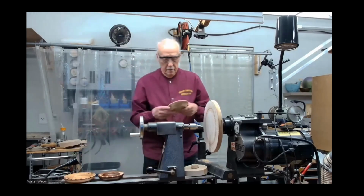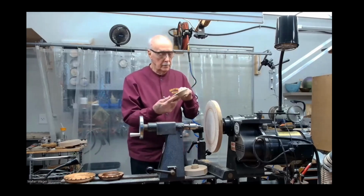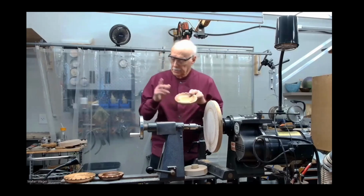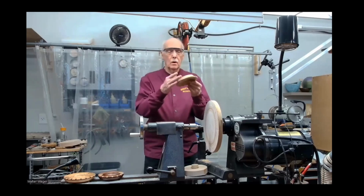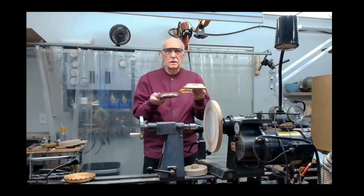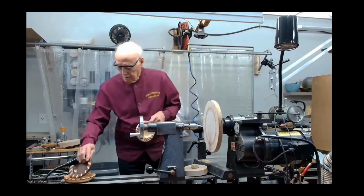This one, I did the same kind of a thing. I didn't put an inlay in. It's just cut. These are 90-degree slots, cut with about a 1.5 inch cutter, or 1 inch cutter on this. I'll show the inlays later. But same kind of thing. Well, this is an ID cut rather than OD, so that you can get the different shapes on the bottom, as long as you leave yourself enough thickness to do the cutting on the top. Okay,